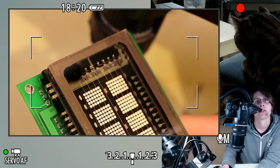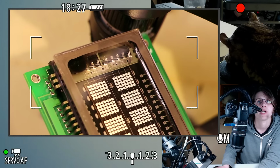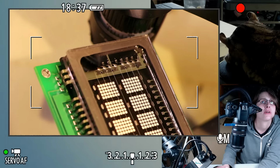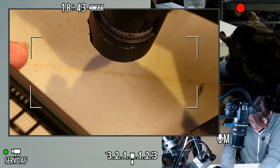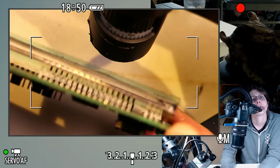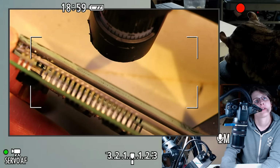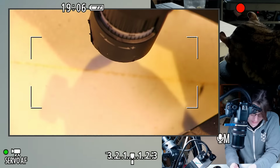You can see the fine grid wires over there held under tension by little metal springs, just to hold them tight and keep them from wobbling. That's part of what the noise is coming from. I think those wires are still chiming a little bit when they get mechanically bumped. So, there's not much else to see on the front side. You can kind of see through and see that there aren't really any components under the VFD, which is probably good. And the VFD itself is a couple of layers of glass bonded together with some kind of spacer allowing the lead frame to poke through.